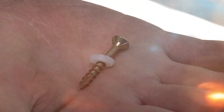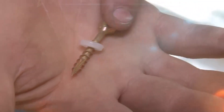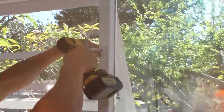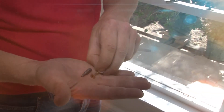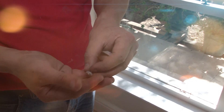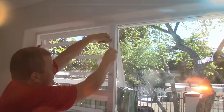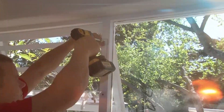Use stainless steel or galvanized screws which won't rust over time. These are self-drilling screws which have a drill bit built in, so we don't need to drill pilot holes — quite a nice idea. Each screw is fitted with a cup that the screw head nestles into; it looks much like a plastic washer. The driver being used here is an impact driver, which is powerful and perfect for this application.